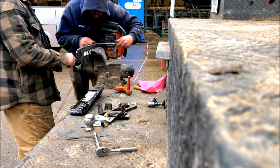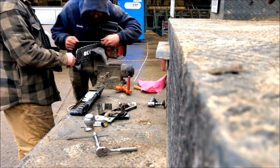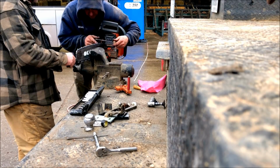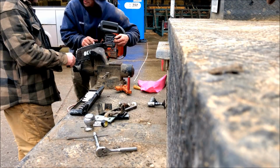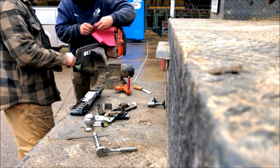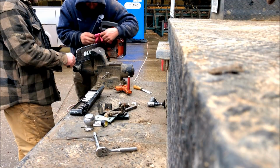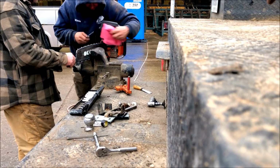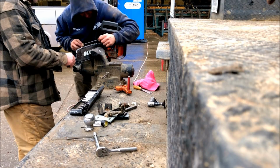I mean, you can get them sharp as anything, and they take a narrower curve. It'll saw faster, but they won't hold their edge long. Like that tooth, I guarantee you it'll be dull next time, more so than the others. Remember I told you it was bad when I looked at it? I don't really know why, but I think it has to do with less metal back there, or else maybe they don't harden them good enough back there.